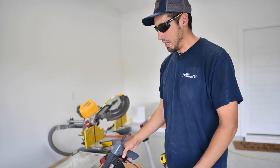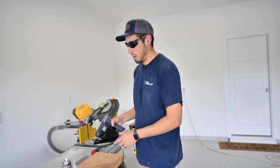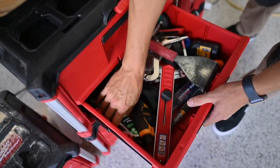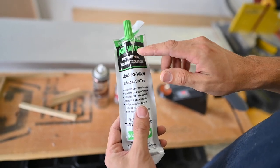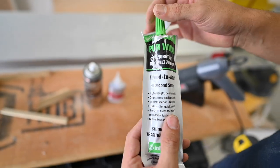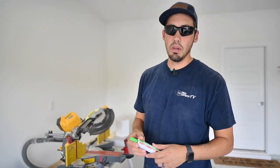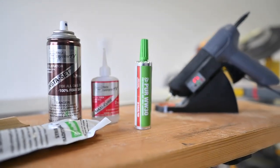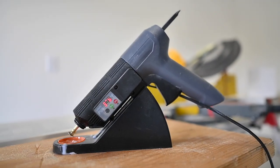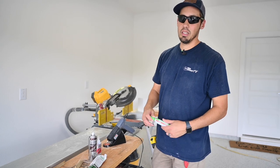This has a cartridge in it that is at this present moment 356 degrees, so I'm not going to take it out. But I do have one down here — this is the cartridge that they take. This is a PUR WW30, which means wood to wood with a 30-second open time. We also sell these on our store — I'll put a link in the description. It definitely helps make these videos possible. We sell these and the guns, and I have the cheapest prices on these guns and glue than eBay or Amazon.